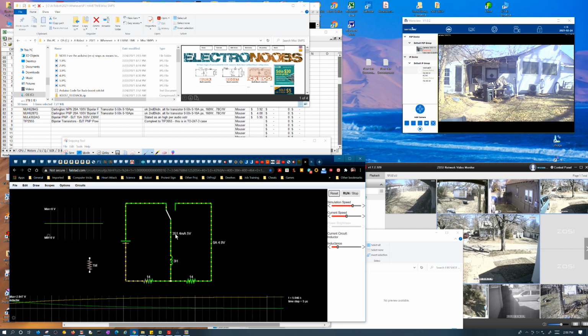So like I said, you will get 350-ish milliamps charged up. Now, watch what happens over here when I change the switch. This will go up to start at 350 milliamps. See? But the voltage has inverted because it's trying to maintain that current flow. That's the secret to inductors: realizing that anytime it changes state, it's trying to maintain that current flow, no matter what.